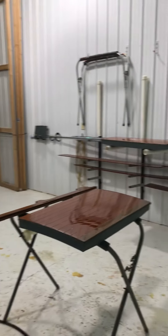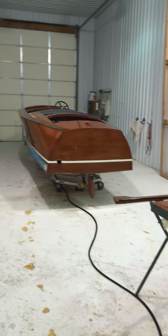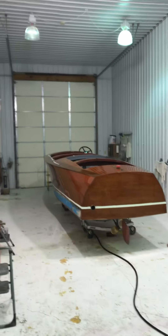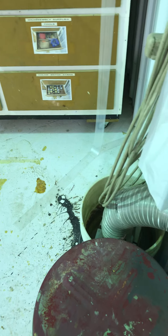So Thomas, I just pulled into our varnish room to take a look at your masterpiece over here. I thought I'd show you — we have a fan out here on the wall that we pressurize the room with ever so slightly, so that leaks from the room are leaks of clean air out instead of dirty air in.